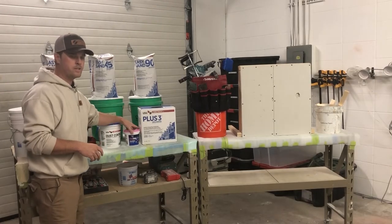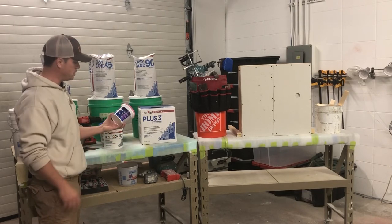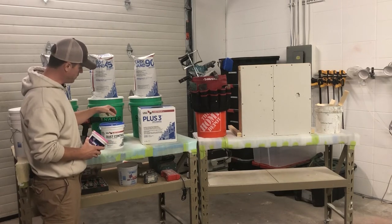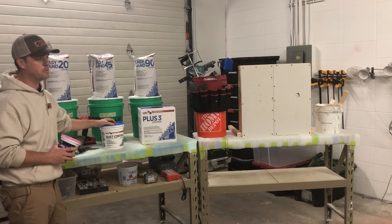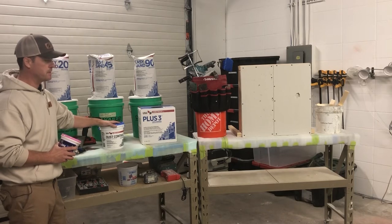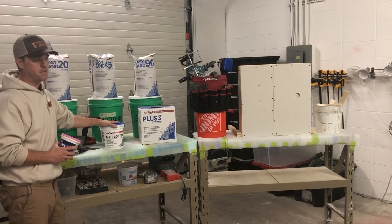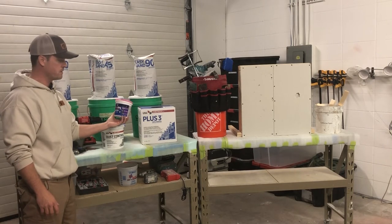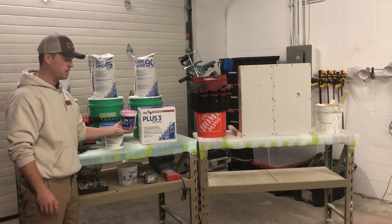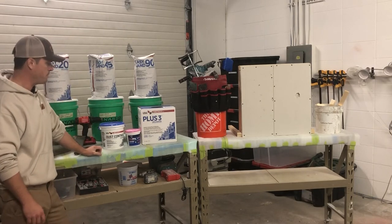Mitch had a question about the difference between these two. This one is lightweight — it's going to dry a lot faster than the other. We're usually not going to be using the heavier one unless we're doing some kind of skim coat application, like scraping popcorn texture off going smooth, or repairing a bunch of tape joints on the final coat. Otherwise, for any kind of small ding in drywall, we're going to use the lightweight because it spreads out pretty quick and dries faster.